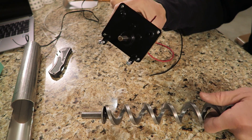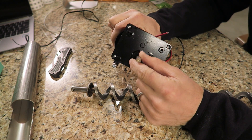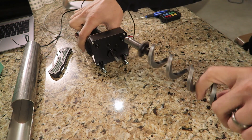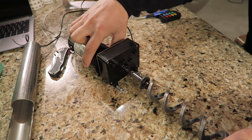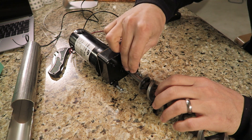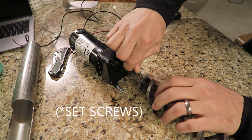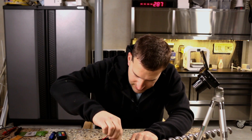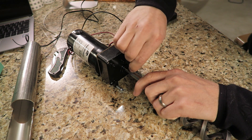This gear motor has a 5/16 shaft with a flat side on it. I needed a way to lock the auger so it would rotate with the motor. So I ended up tapping the end of the auger shaft with a 5mm tap — threaded it — and I have a 5mm screw. That should give us the ability to lock it to the motor shaft so the corkscrew spins when the motor turns.